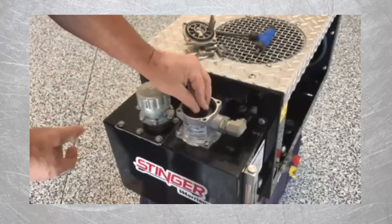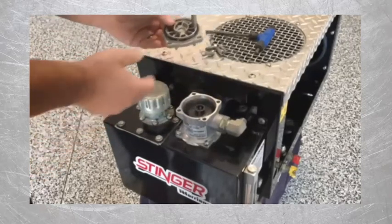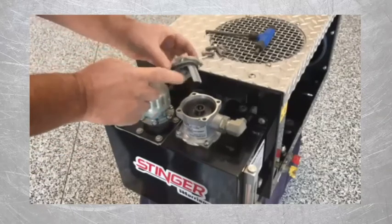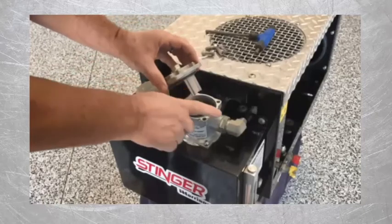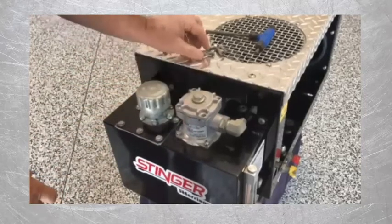Place the filter back into the housing, ensuring that it's centered over that pipe at the bottom of the housing. Before you reinstall the top cover, make sure that the O-ring seal is in good condition and in place. Then line up the diffuser with the fitting on the side of the housing and press it down.